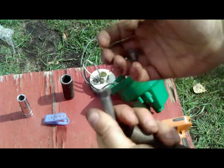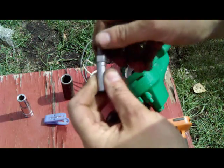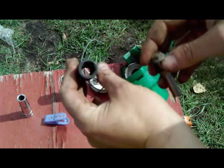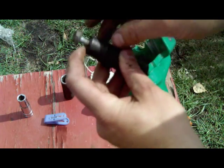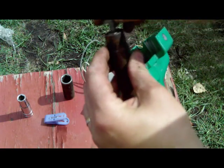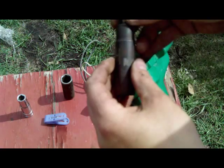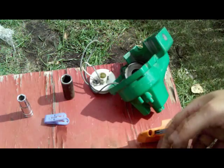This is my flywheel nut. I got that on there because I'm going to weld it and I don't want to get any welds on the threads. This is the socket — I had to actually drill it out to fit in here. Now it fits very snug, there's no play at all. I'll just weld a couple welds on there with the stick welder down in there, bolt it on, and that's my hub.